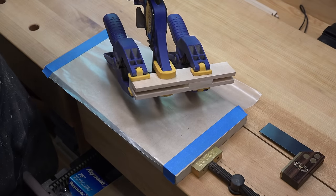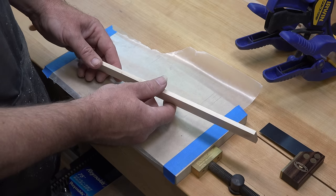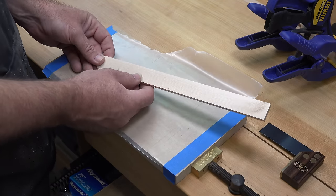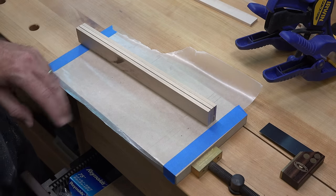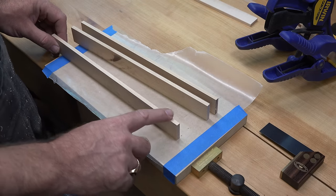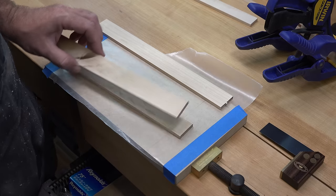While that assembly dries, we're going to move on to other parts. You need to make the bar: quarter inch thick, one inch wide, and 12 inches long — one per clamp. Set that aside. For the stationary arm you'll need, per clamp: one piece that's inch-and-a-quarter by quarter-inch thick by four and three-quarter inches long, plus two pieces that are quarter-inch thick by inch-and-a-quarter wide by six and a quarter inches long. Cut those and then we'll glue them together.